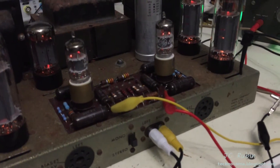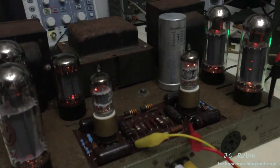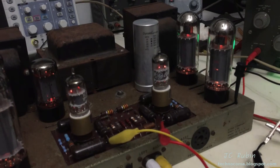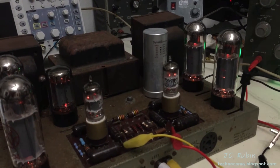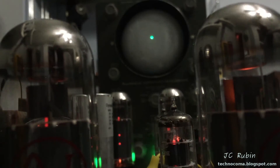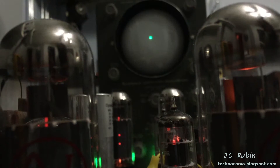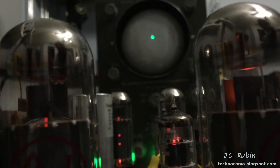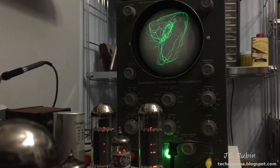Clipping off at the phase inverters is obviously going to make that a lot easier. This will also allow me to increase the amplitude — or the size of the picture — both X and Y, by increasing the volume, because that does have a net effect. I've had to move the connections on the ST70 to the other side of the phase inverters because the picture was coming out upside down, so that was the only change I had to make. Let's get started!